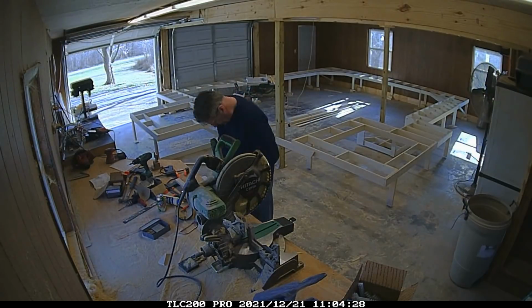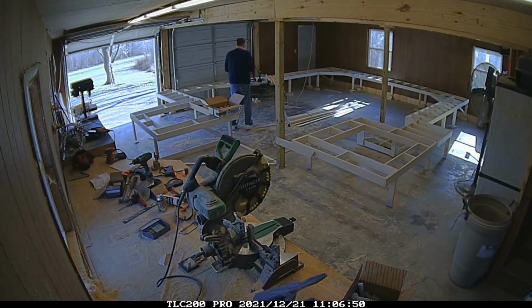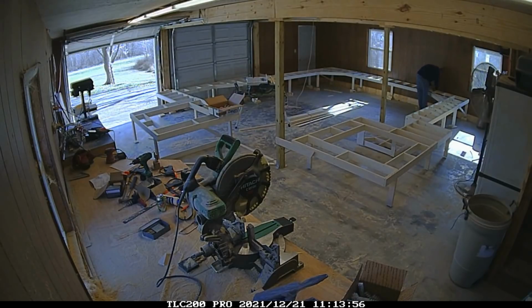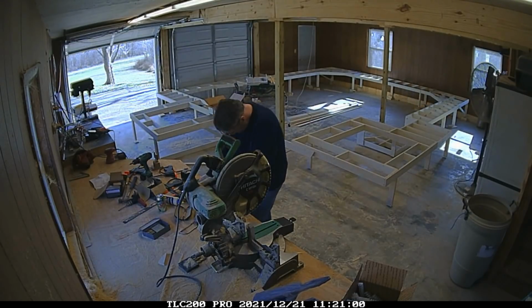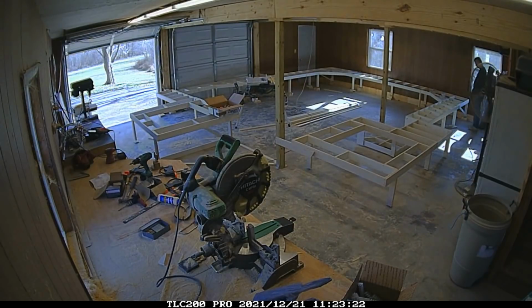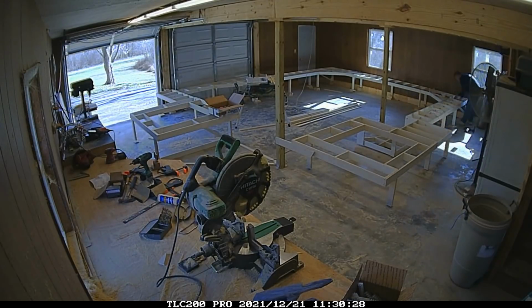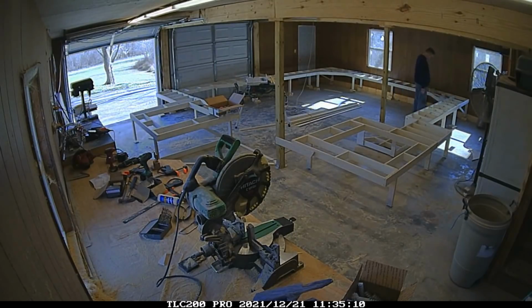I need one terminal block at each benchwork joint so that I can separate the wires and rejoin them easily again upon installation. And it's not just a simple case of one pair of bus wires, because it is intended to have all these staging tracks individually isolatable. And since there are 9 tracks, that means 9 additional single bus wires. And I have to run those all the way around the U shape at the far end of the room. The ones on the outside are significantly longer than the ones on the inside though, because of the shape of the end ladders. You'll see me lay those out later in this video.